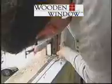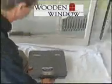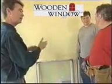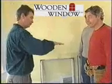Next, Simon removes the trap door to get to the weight pocket. Oh, that's interesting. Why the scale, Bill? Well, you got to make sure the windows match the weights, and the weights match the windows. Absolutely. Otherwise, they'll either go up or they'll fall down and do the guillotine thing.